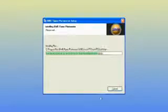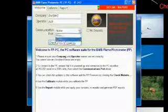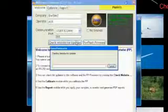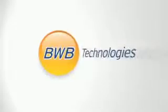The FP PC software package, included free of charge, aids in calibrating and generating reports that can be stored electronically, sent over the internet to colleagues or printed from the computer. Although it is not necessary to connect the BWB XP Flame Photometer to a computer, it does offer valuable advantages to the user. Attach either a USB or RS-232 cable to both the BWB and your computer.